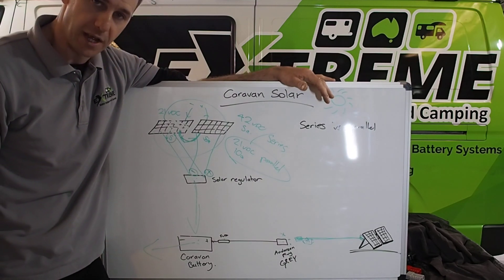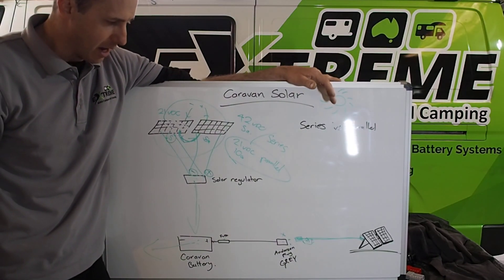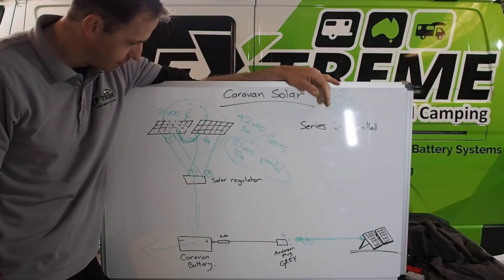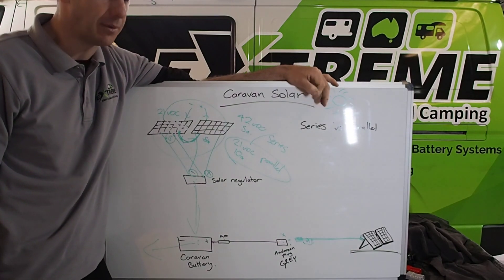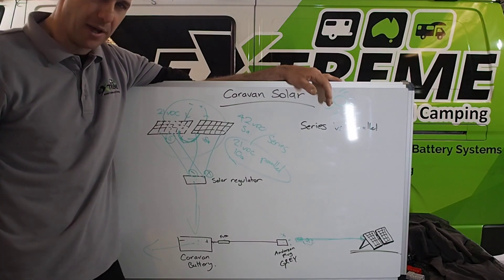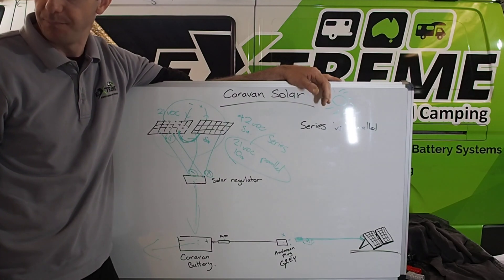Blankets have their applications and they're completely fine, but I do prefer the fold-out type — the glass type or the lightweight rigid types — because they are in parallel with lots of airflow, and keeping the panels cool is a big advantage. I've been peeling thin-film panels off roofs for years — back when they first came out, no one really knew, and we started fitting them with a small air gap. They worked for a while but their efficiencies just fell off. You still can't beat a good old glass panel with some airflow under it.